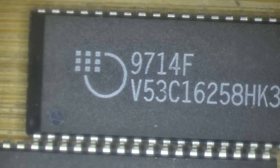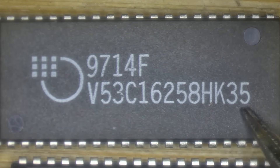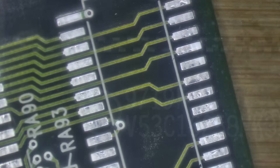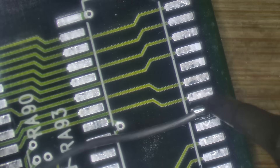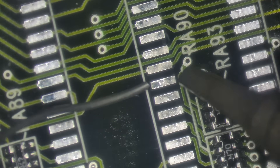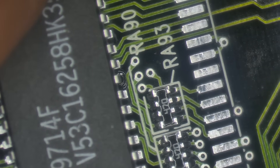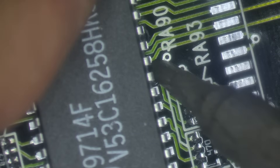These are the replacement chips that I found - they are also 35 nanoseconds, as you can see here. I'll try my luck with these two replacement chips. If this works, then this is the first time a memory problem caused a Voodoo card not to work, at least for me. That's very interesting. The pattern we've seen before may be linked to faulty FBI memory.